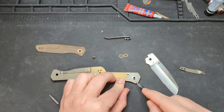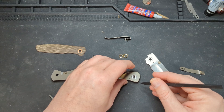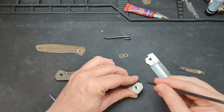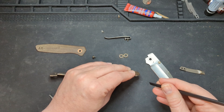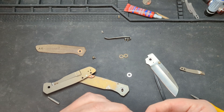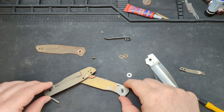And then we have the bearing racer right here, which I'm going to get out and clean as well. I'll just let gravity do its thing. The pin that fell out with it is another pin that sits into the scale and it's not secured in any way, shape or form. So just be aware of that and don't lose it.